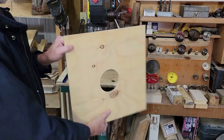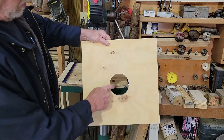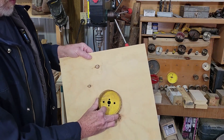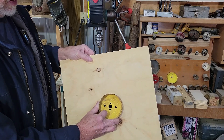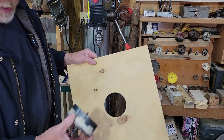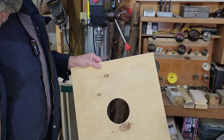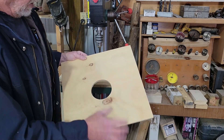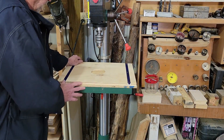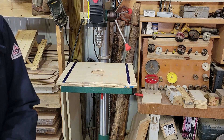For the surface itself, I cut a piece of plywood the same thickness as the rails and cut a hole in it using a big hole saw. I used a four-and-an-eighth inch hole saw for that. Then I cut the second piece of plywood with the next size down, positioning the hole just off-center of the drill, so that when I put this in and line up the front face I can use the surface effectively.